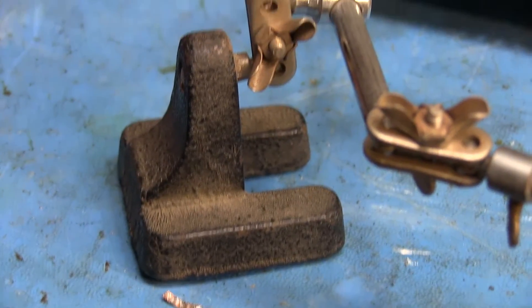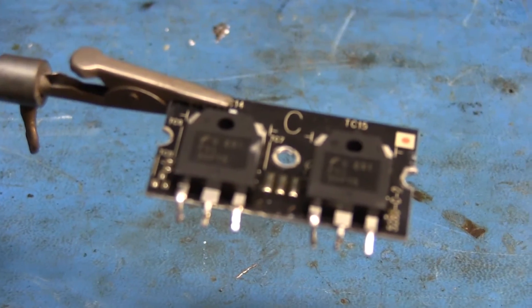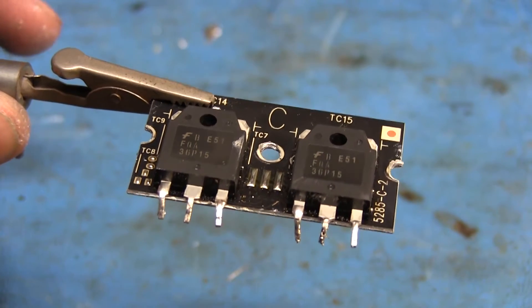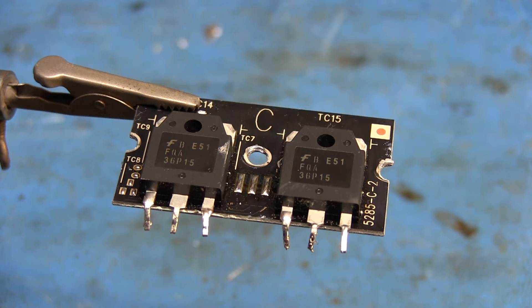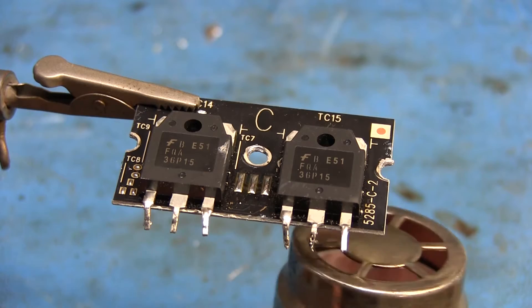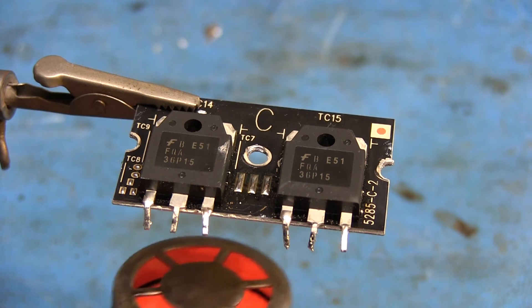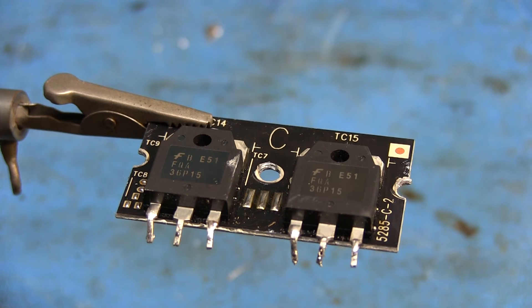To remove the old parts from the thermal plate I'm using one of these little helping-hand things to hold the board for me. The easiest way to do this is to take a heat gun and just heat it up from the bottom until the components loosen up — in the case of this board two components, on the other board it'd be four. I just blast it with heat from the bottom and since I'm not really too worried about saving these particular parts, I'll just heat it up until they loosen up and then pull them off with pliers. I try to keep the plate level so that once they heat up the parts don't accidentally slide off.